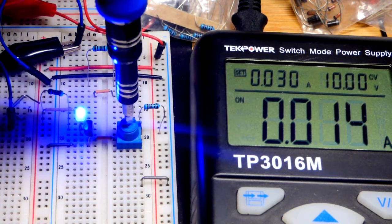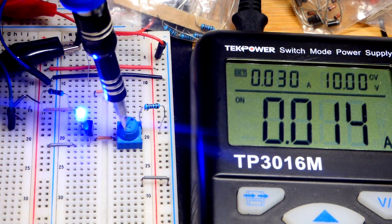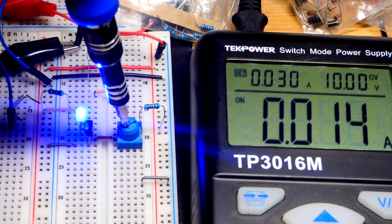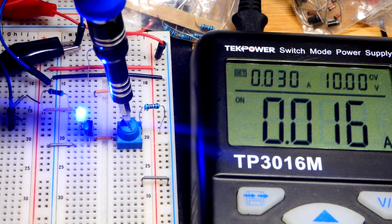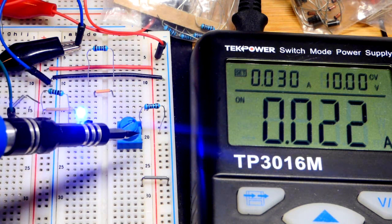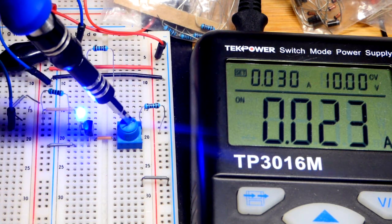really, at all. It looks like we have enough base current. We are not saturated. We can tell because of the current there. Well, yeah, we go down and we come up, and you can see current holds pretty steady. So we probably are saturated. And then when we get about here, you see current rapidly rise a bit right at the end there. That's because it's 10,000 ohms of resistance across this element, and it lowers. But we also have this 1 kilo ohm resistor in series, and that's why I put that there.